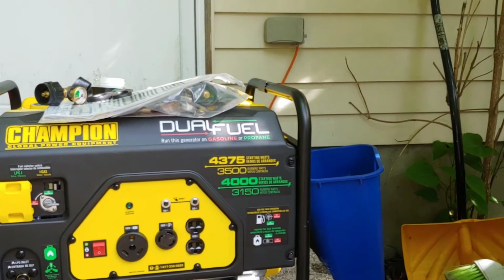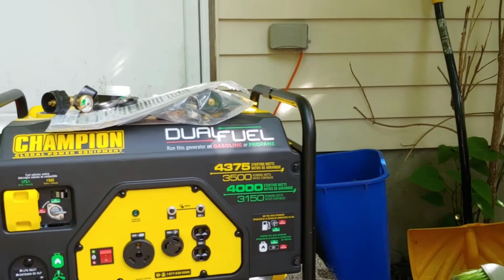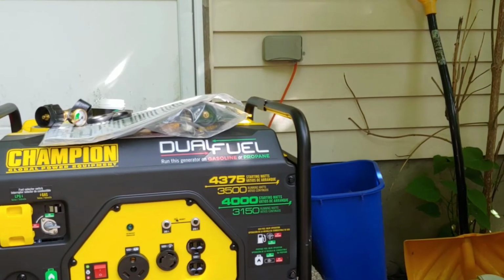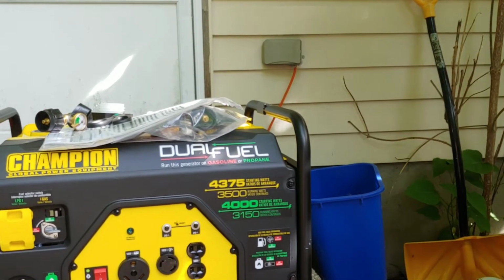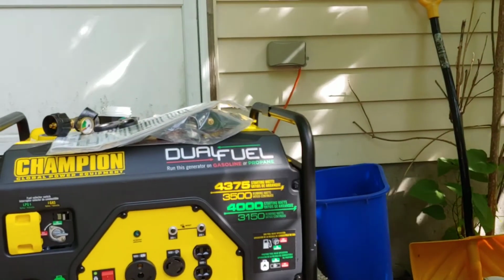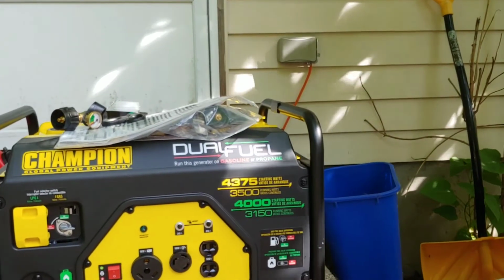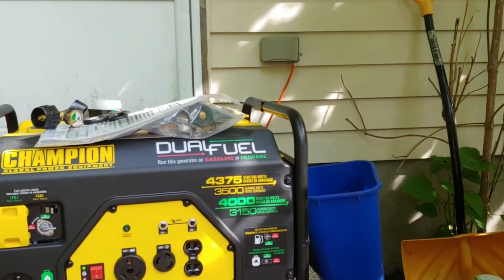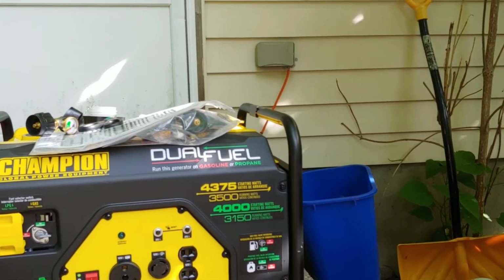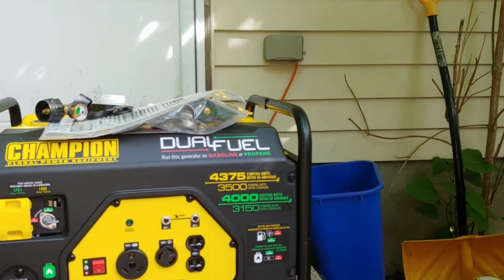So I gotta get me some probably 50 amp indoor Romex to bring over here so I can do the switch over. I want to make this one the above ground or above the house power supply, and then my Honda 3000 that I'll use for the bottom. And then once I get the RV's Onan 5000 watt running, I'll have that as the backup to backup to backup, because that uses a fuel tank in the coach itself, and right now that's probably pretty ganky. So that's the summer project.